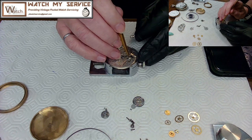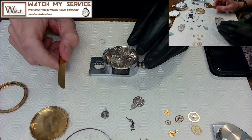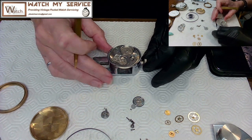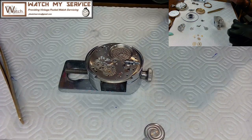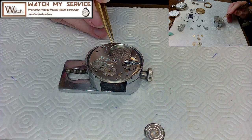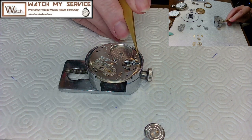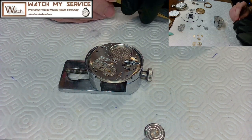I move this forward to make sure the clutch can grab, then press it into position and get it somewhat snug. You can't press the button and tighten at the same time, which is the tricky part. Once it went in nicely I just had to move things into position. The pinion, clutch wheel, and stem are now in place.